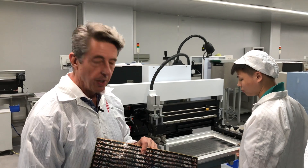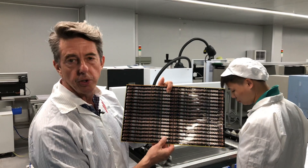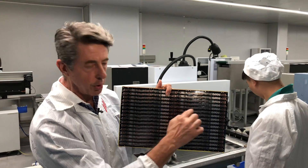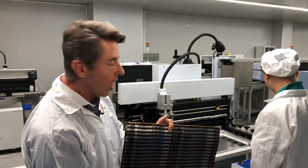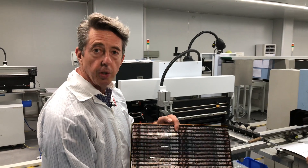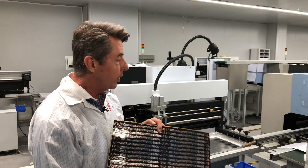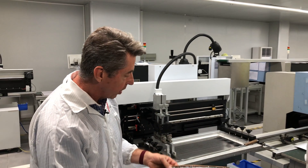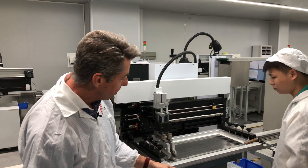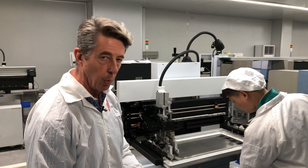This is the next part of the process. We apply solder paste onto the printed circuit board. This is one of our printed circuit boards — it actually has 16 strips in it. The machine behind me works just like a t-shirt printing machine, which is a silk screen process, except instead of silk screening ink on, we use solder paste. The board is loaded into the bottom of the machine and the solder is squeezed through the top of the silk screen onto the board.